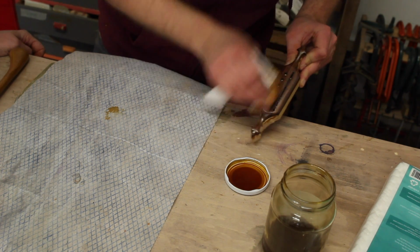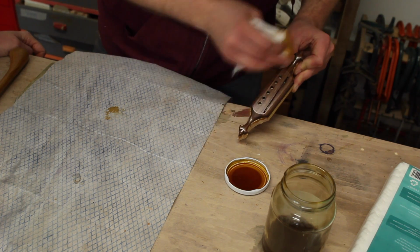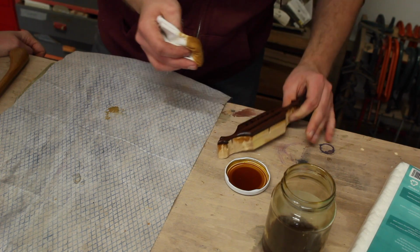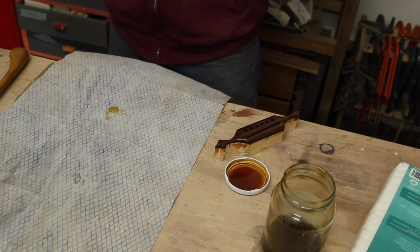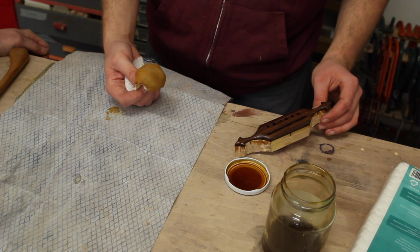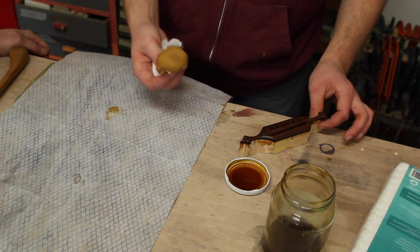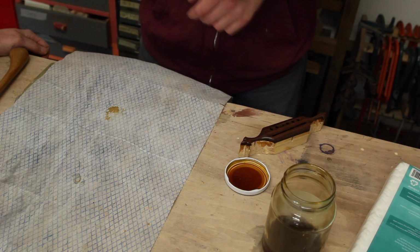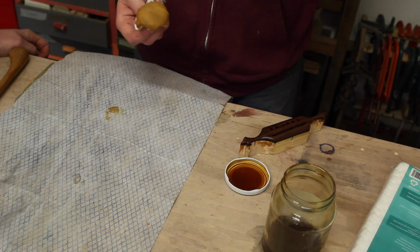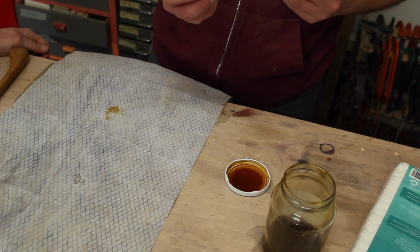Is the reason for using cloth like this that it effectively is a very mild abrasive? Yes, slightly abrasive, ever so slightly, thousands of grit, if you will. But it also acts as a natural filter, and it's soft and won't leave any residue. Most importantly, with paper towel or something like that, you will end up with small threads embedded in your finish, which is not ideal.